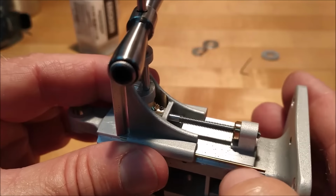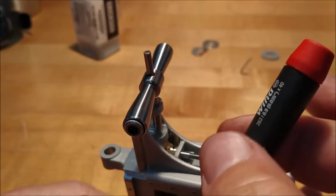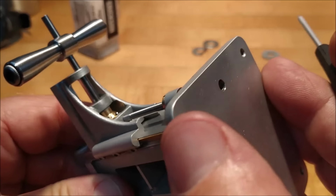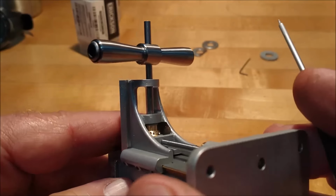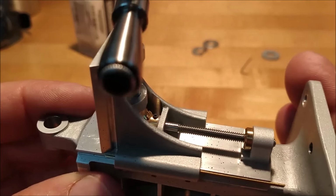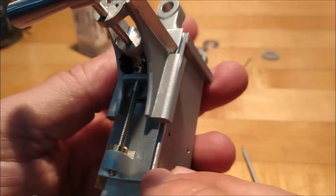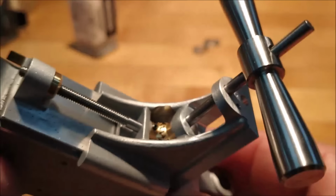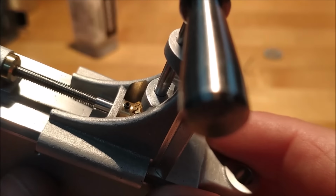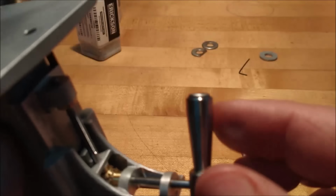Observation or change number two is I took 20 thousandths of an inch off of each one of the rotating facial surfaces in here on the brass gears, and I made 20 thou thick silicon shims for it. I don't know if you can see them or not, but they're in there. So that the rotation is no longer brass on aluminum. There you go. No longer brass on aluminum. It's brass on the silicon bushing, and the silicon bushing rotates against the aluminum. So it is incredibly smooth.